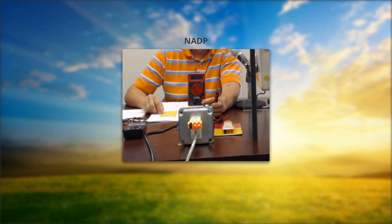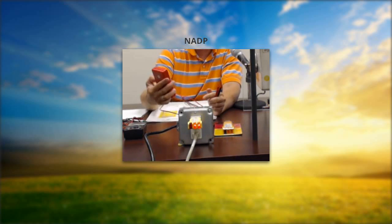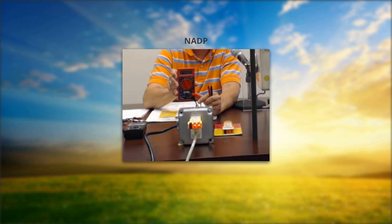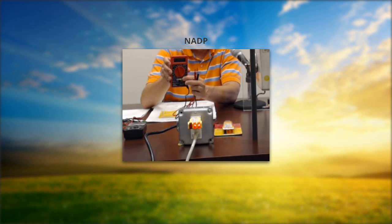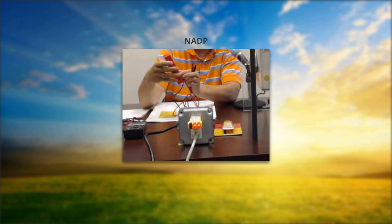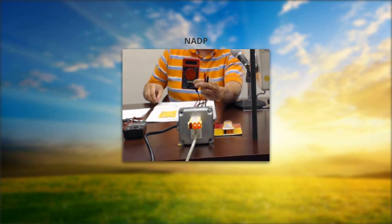Looking at page five of the handout: various meters use symbols and your meter probably comes with an instruction book. We will be using the straight-line indicator for DC voltage — ours is marked DCV, standing for DC voltage. We'll also be using what's called a diode check — the sixth symbol down, showing a one-directional current like an arrow running into a wall — to check the condition of our fuses. Those are the two functions we're going to be using today.